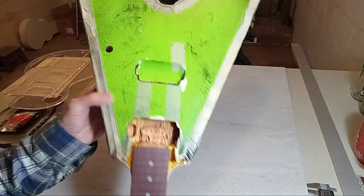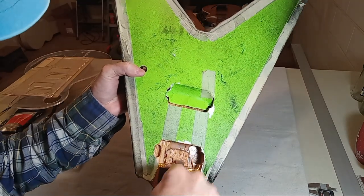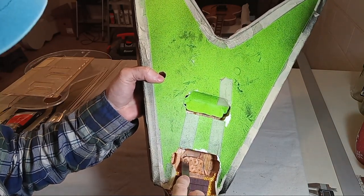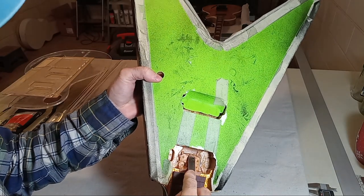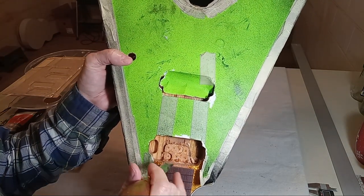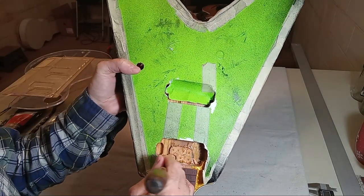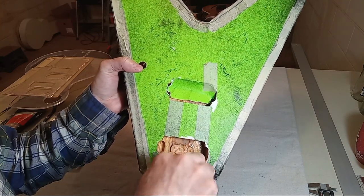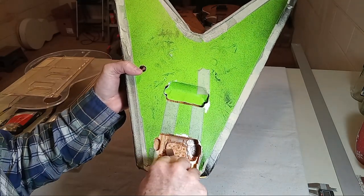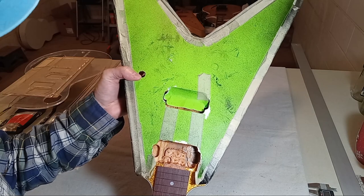Okay, at this point all you're doing is relieving some material. One thing I recommend: if there are any little sharp corners that the router bit might catch on, go ahead and knock those off — come in from the top with your little mallet and knock off that little corner. If you've got a really good router setup and work your way to the finish line you should be fine, but I'm the world's worst at slipping up and the router bit catching and jerking and creating a little problem.